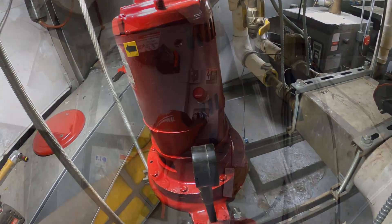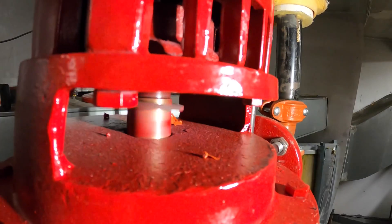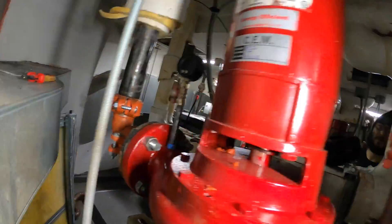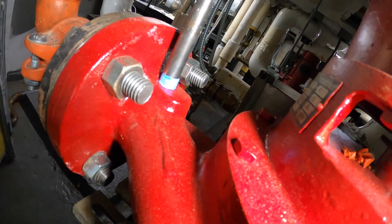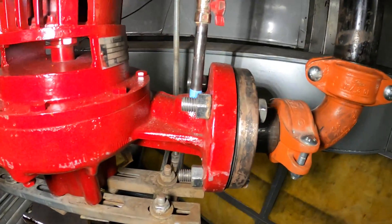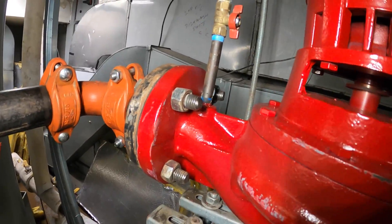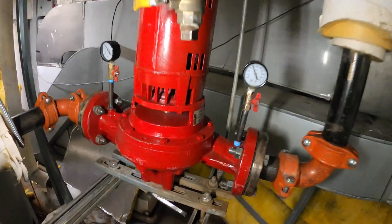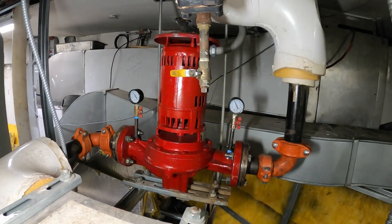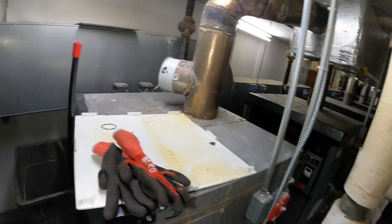We're going to test it again — we should be good now. Put it on hand. It's going that way, and that is the direction of the motor and also the direction of the pump — there's an arrow. That right there is a beautiful thing. No leaks. We've got a pressure difference, even though I don't think those gauges are reading properly. Everything's wired right, we've got the right rotation. We've got heat in and out, and these people are going to get pressure and heat to wherever this goes. I believe this is from the basement to the second floor, working in conjunction with these two boilers.